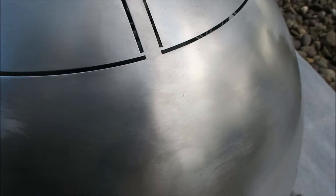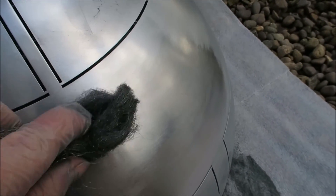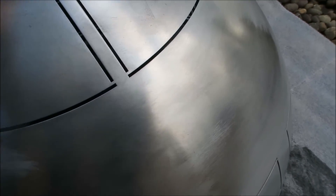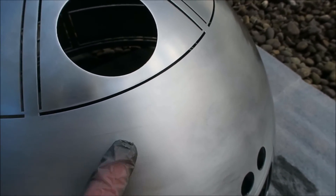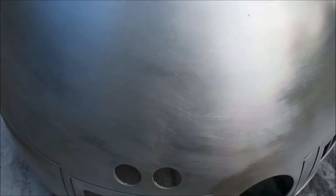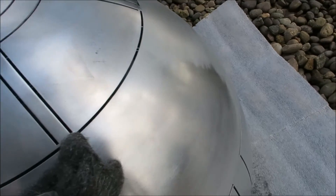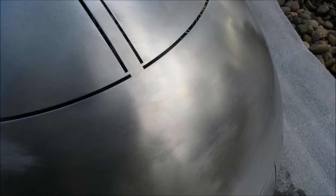Okay, so currently the dome is very, very shiny, but I want it to have a matte finish. So what I'm doing is going over it with steel wool - if I rub in one place it goes kind of white and quite matte. You can see this bit here has been rubbed over with steel wool and it has a matte finish now. It's not very even, but if I just run over it in the same direction that'll give it an even finish. You can see the difference - this bit hasn't been done, this bit has. So just to summarise: steel wool, give it a rub until it goes pale in colour, keep going until you've done the entire dome. It's a lot of effort.